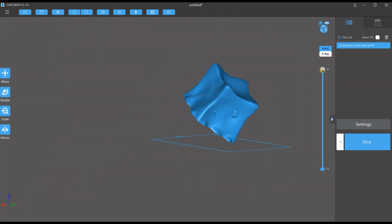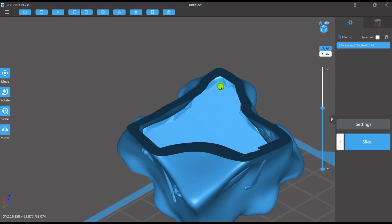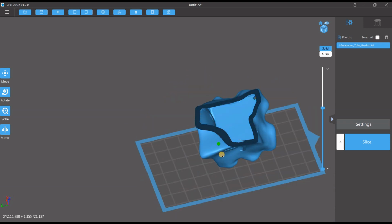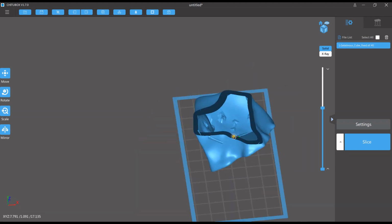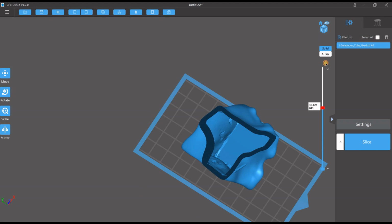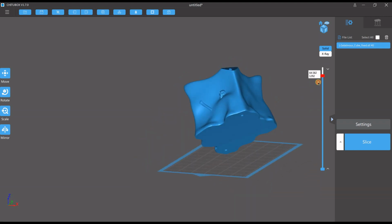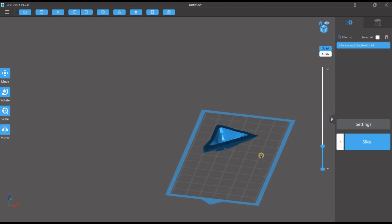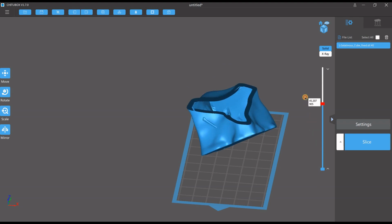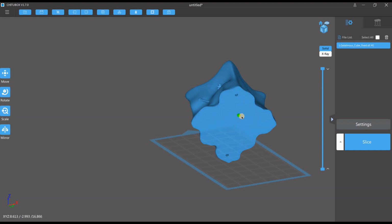To make cleaning easier, we're also going to want to plop another one over here at the top, because when you drain the resin, you will have a point where the resin flows out, air flows in, so it'll make your process a lot easier, unless you want to go for a significantly larger hole. So we're already on the right track for a successful print because we have a hollow model with very small per layer surface areas, and it is appropriately vented to prevent a pressure buildup.